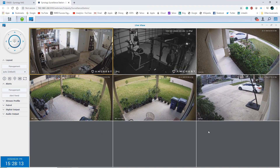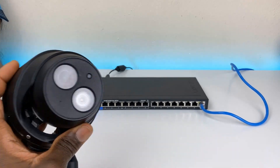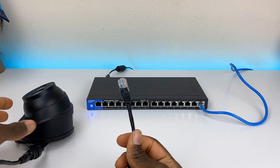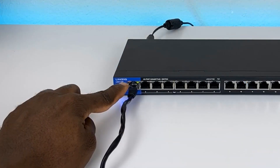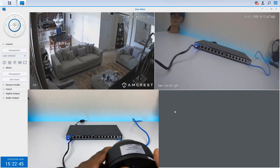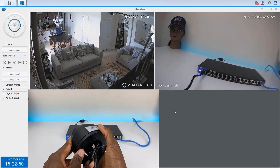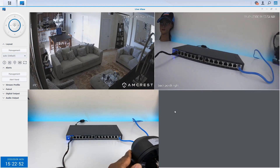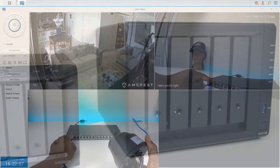Welcome back everyone, Triple M here. Today's video I wanted to show you my security setup for my house. A week ago I released a video showing you a new switch that I purchased, essentially for this purpose. What was unique about the switch is that it had PoE on eight of the ports; the other eight ports were standard. With the eight PoE ports, or Power over Ethernet, I was able to power my cameras. The aim was to pull all the cameras off my current NVR, which was a little bit loud and not compatible with the new cameras I purchased.